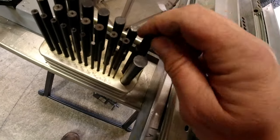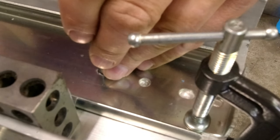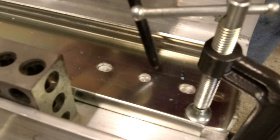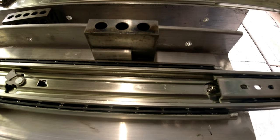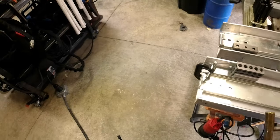You just have to find the right size and get it where you want it. Put the center one in. On this end they gave you a couple of access points to get to the locations — there's one there and one there. We'll get them drilled out, tap these, and put a lock nut on the back side just to make sure they don't move.